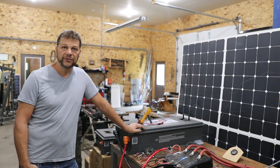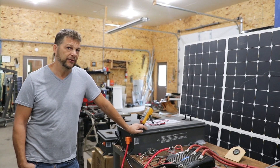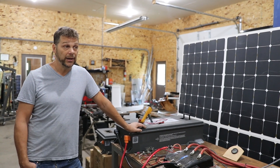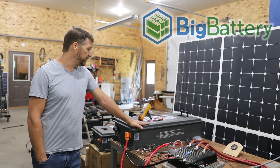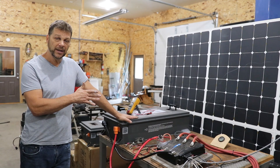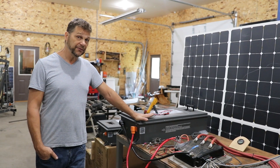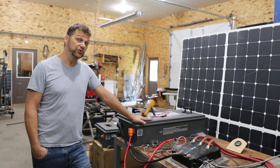There's enough there to give you a 50 to 75 horsepower equivalent, which electrically is pretty good. This motor's redline is around 6,000 to 6,500 RPM, but the AC motor will do 8,000 — that's just going to give us more speed. With an electric motor we have max torque all along the curve. We're using the AC50 coupled to a Curtis 1238-7501, max amp about 550 amps. These batteries will put out 150 amps continuous, and we're going to be using four of them. We did get five but the weight was getting a little much.